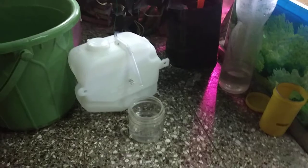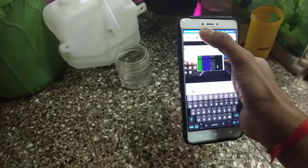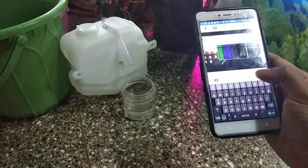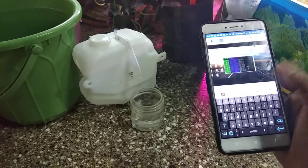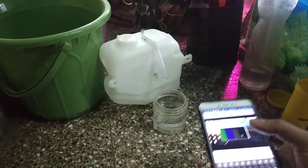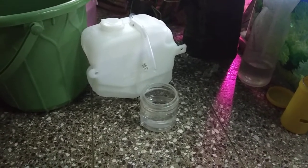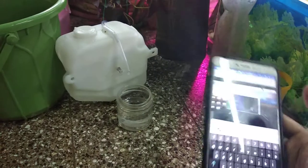This system works with the Raspberry Pi connected. We will schedule a script and run it. This script waters the plant for one second — I measured that one second delivers about 10 ml of water per dose. This script can be scheduled using a cron job so it will water the plant on a daily basis.